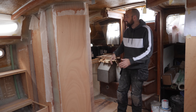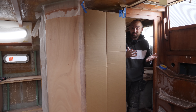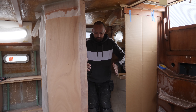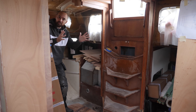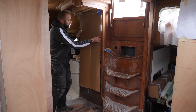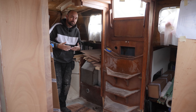While I'm waiting for the epoxy to come up to temperature, let's take a look at some options for the head — it's the next item on my to-do list. There are two options as to where I can put the door that's going to give me access to the head, and where I put the door is going to determine a lot of the layout in here. Option A has the door further inside the boat and option B has the door a little bit closer to the companionway. I personally much prefer option A because you get access to the middle of the room, meaning I can put stuff on three sides: the sink over here, the head behind me, and the shower here. No matter where I put the door I'm going to be sectioning off the area aft of the head — that is going to be my little technical area. In the technical area I'm going to have stuff like the isolation transformer, the charger, the inverter, the boiler, some of the batteries, tools I don't use all that often, stuff like that.